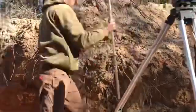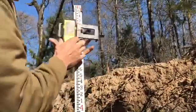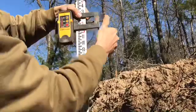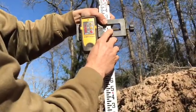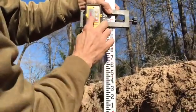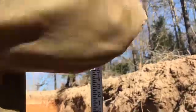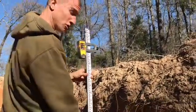This is the receiver side — when you push it on, it beeps when it's at grade. You can see there's a color indicator on this particular model. Red means it's high and pointing down. As you come down it beeps blue, meaning you need to go up a little bit. When it hits the level point, it beeps and you know you're good to go. So you establish your grade at one spot, then move to other locations to compare.